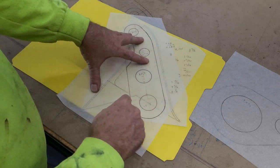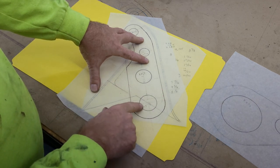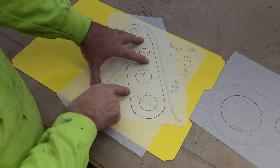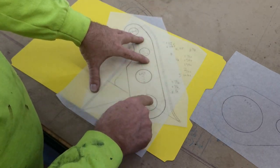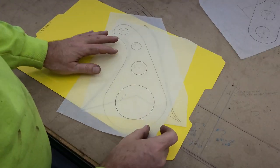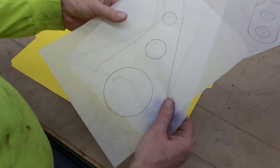The way this is going to work is I can weld across here, which supports this area a little more, and then I'll weld across here, which will actually go across the weld seam and grab both sides of it. So even if that seam developed a crack, this piece should theoretically hold it together. It'll be perimeter welded, and each of these holes will be welded on the inside. And on the outside of the frame where we're not attaching anything and we're just being decorative, we're going to do it like so. That's the plan.